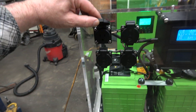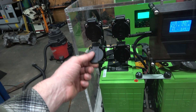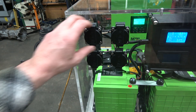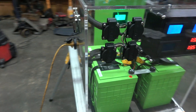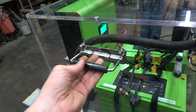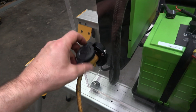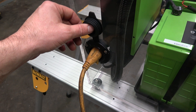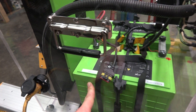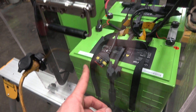Here I have my power outlets. Combined, I can provide a sustained 20 amps total out of these four outlets with a 40 amp surge total. That'll run pretty much anything you can plug into a 15 amp receptacle. I've got stainless steel spring-loaded handles that are strong enough to handle the weight of this entire contraption. Right here is where we plug our power in — this provides power to the inverter, which then charges the batteries, and I have the inverter set up for the proper battery chemistry so it doesn't damage the lithium batteries.